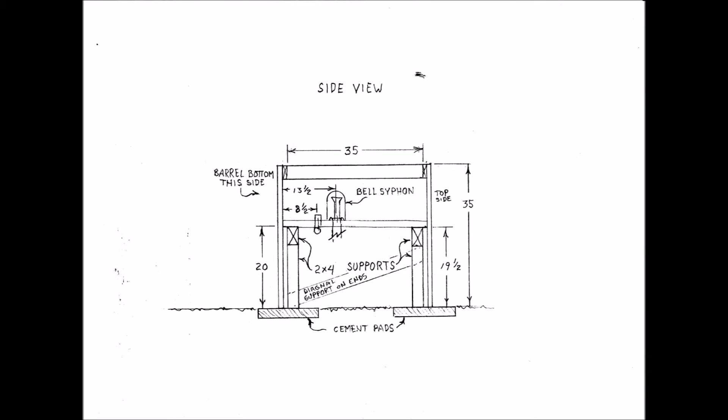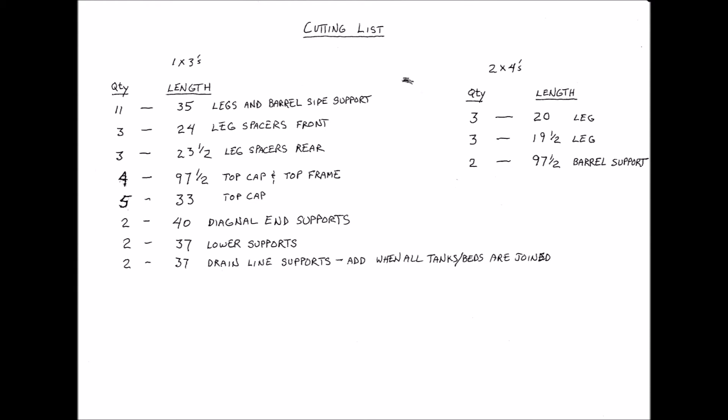I've included a cutting list. On this cutting list my measurements are from lumber that was milled at the actual dimension — this is rough cut lumber — and so my one by three measures one inch by three inches. The dimension it will affect will be your horizontal cut. If you're using lumber from a lumber yard you're going to have an eight foot length to the grow beds. Mine is measuring 97 and a half inches. If you're using the three quarter inch dimension instead of the one inch it should break out just about right at eight foot.